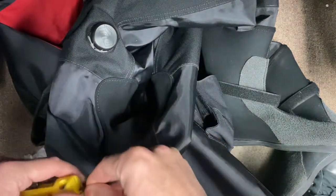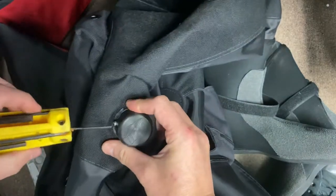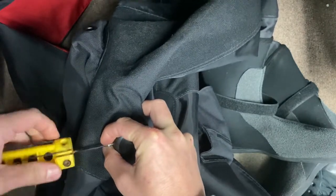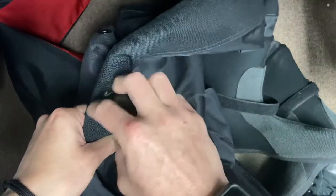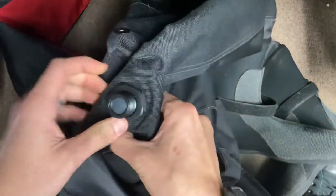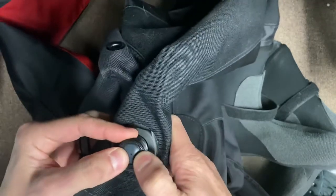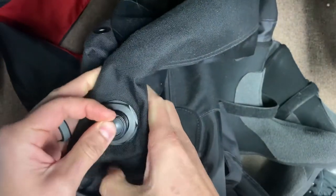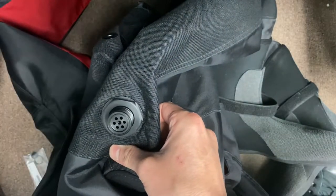The first thing I'm going to do is loosen up the set screw. I am using a 3/32" Allen key, and I'm just going to remove that set screw. Then I can go ahead and remove the protective cap. Now I've got access to my O-ring, which is right here. Just do the little squeeze technique and it'll pop right out. Then I can go ahead and remove my little exhaust valve, or flapper valve.